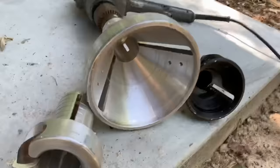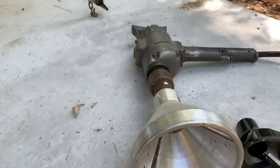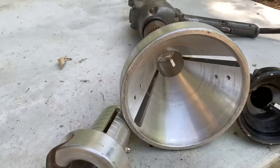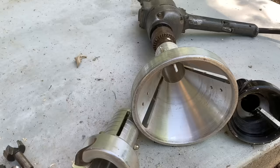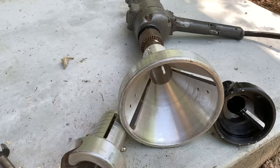Lumberjack makes these tools and they do sell a three-quarter drive drill. Milwaukee also makes a three-quarter drive drill that will turn this bit. This bit is turning a six and a half inch log down to two inches, so you can see the material it's using. The recommendation I'd make is to go ahead and get the vise that holds the drill and the log down, so you're not trying to hold this. Just go ahead and get the vise and be done with it, because that drill right there will hurt you.